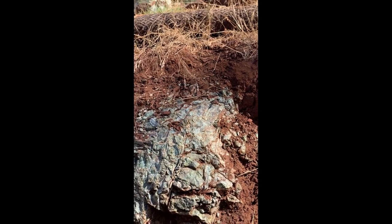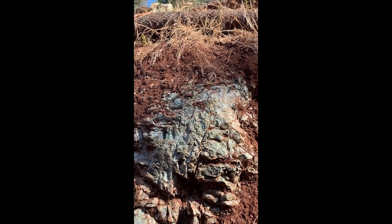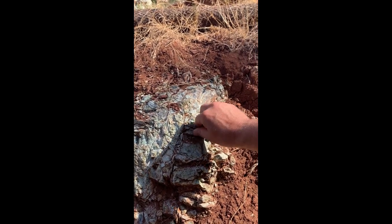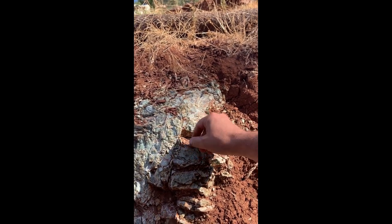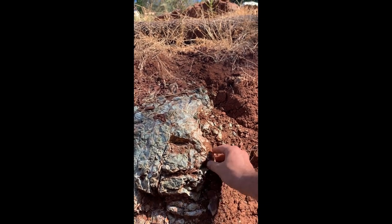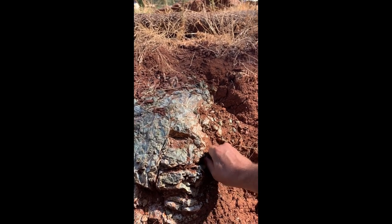Now greenstone, it's not the hardest rock in the world. You can cut through it with the jackhammer, you can hit it with a wrecking bar, but it's just time consuming. It chips off in these little pieces and it just takes forever. But if you don't have a jackhammer, you're going to be here forever. The other problem with greenstone is it's a natural asbestos carrier. So you have to be careful. If you do use a jackhammer, take a hose and just wet it down a little bit. You don't want that dust floating around you.